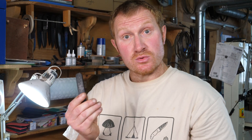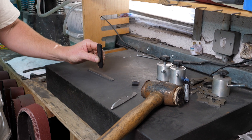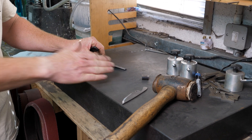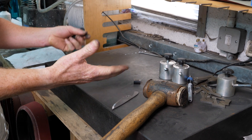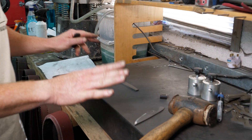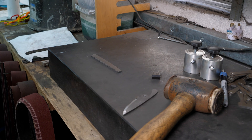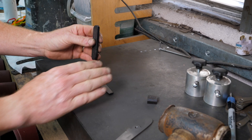We'll take it through to where I've got some blades and give them a test run. We've come into the grinding room where I've got my granite surface plate, which I use for scribing lines. All the engineers out there will probably cringe, but I use this for putting my hand stamp marks on. I like to use the granite because it's relatively smooth compared to the surface of my anvil, it's got enough mass so it doesn't bounce, and it leaves a relatively smooth finish on the steel. If you support your blade on a very rough piece of steel it will transfer that surface texture to the reverse side of your steel. Engineers will be cringing because obviously I'm going to damage this slightly over the years, but it works really well for me. Make sure you wear some safety goggles just in case there's a bit of debris.